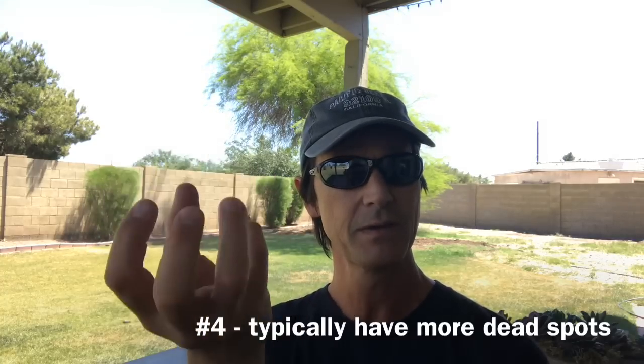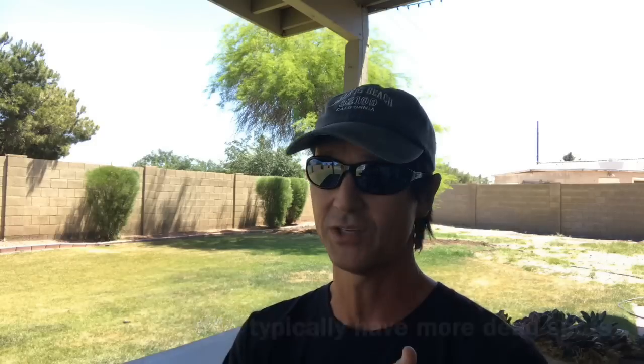Lastly, there can be a lot of dead spots. When those heads stop turning as they get worn and aren't replaced, you're going to get dead spots where the system doesn't blow that area. I showed you that second example where debris always ends up in that little side pocket and never goes anywhere — I have to net it out every time. With a vacuum, providing you've got it set up right with return ports pointed in the direction manufacturers recommend, your vacuum is probably going to hit everything.